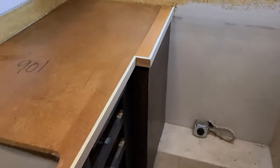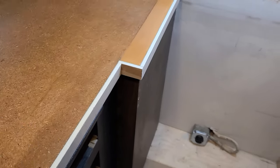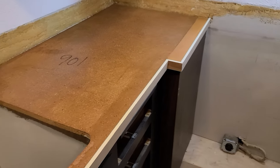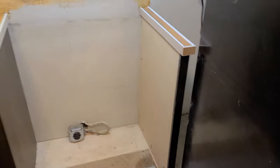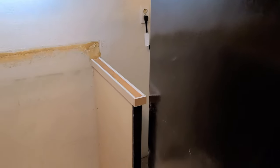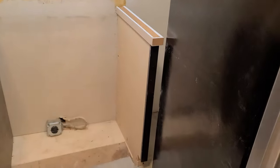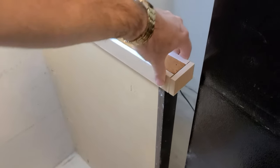Had to do a little bit of repair in this corner over here, and then redo the skirting board. There was an inch and a quarter board on here, and the bullnose that goes on the new countertop is an inch and a half. And then I had to kind of rebuild this little divider wall to make sure there was enough space for the stove and for this refrigerator to go all the way in the back. And that's really just two pieces of three-quarter MDF laminated together. The old countertop piece fascia put on the front, built a new top, and then used pocket holes to anchor it into the stud and into the floor. It's super solid.